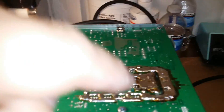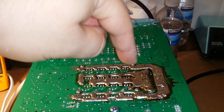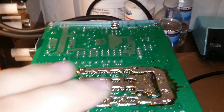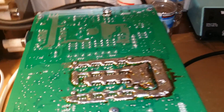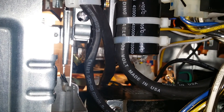I was going to pull some wires from the top — a couple of 10-gauge wires, two on the positive and two on the negative — and go out the top, but I just wanted to keep the original case, so I decided to just drill the holes and you'll see it coming down the side here.